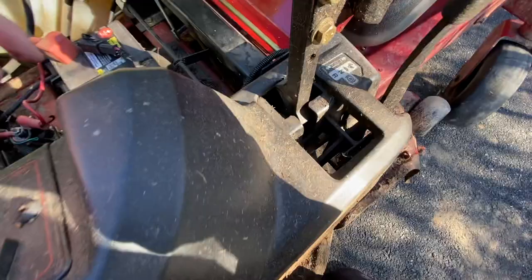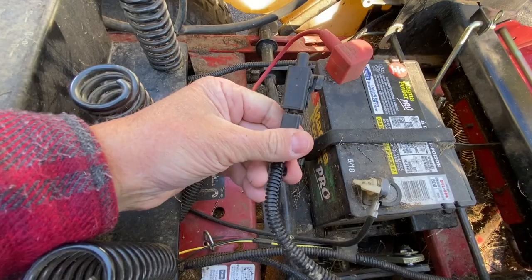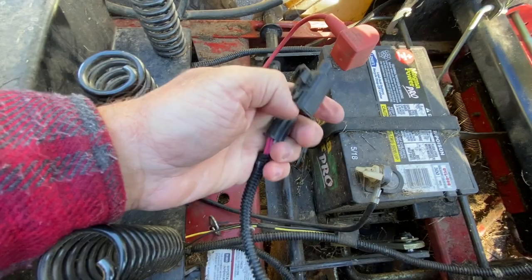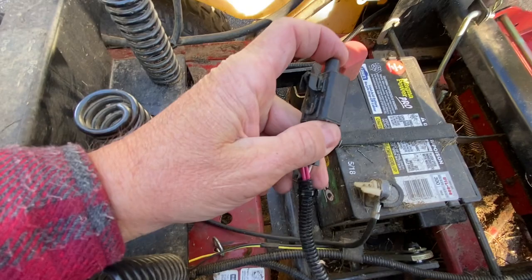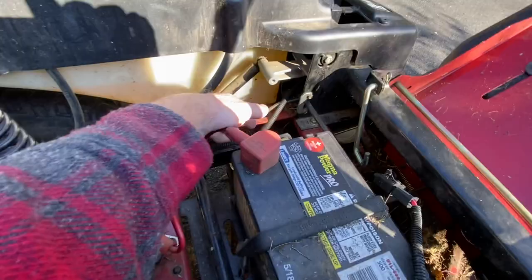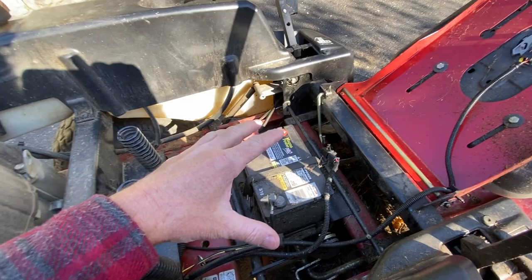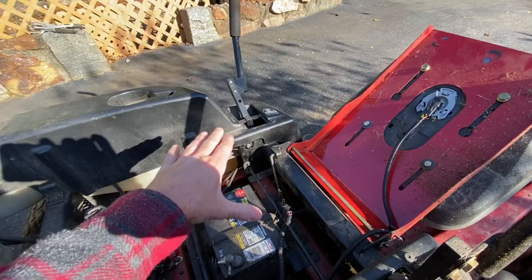There it is — I pulled the safety switch out. Here it is. It was just underneath there and I just pulled it out. It's this little tiny thing that just gets snapped onto the end of the wire, and your handle pushes down on this button. I'm going to get duct tape and just tape around the safety switch, but first I've got to get the other one out. After I get them both out I'm going to tape them both closed. But the problem is — if I tape both buttons closed, because it's an electronic brake, you're telling the mower that your handles are in the out position — that it's in park.